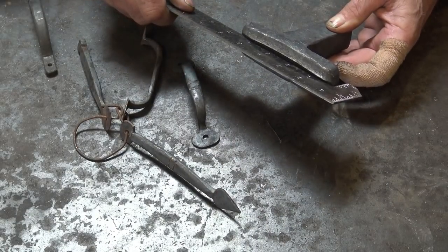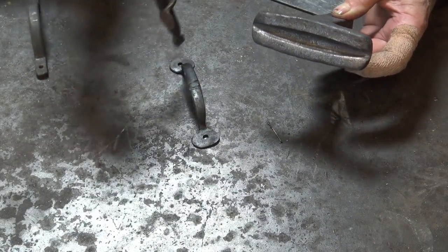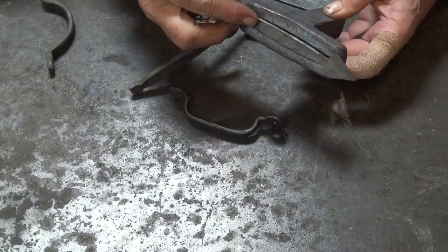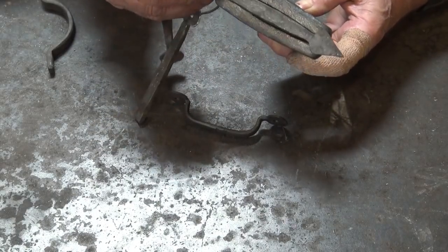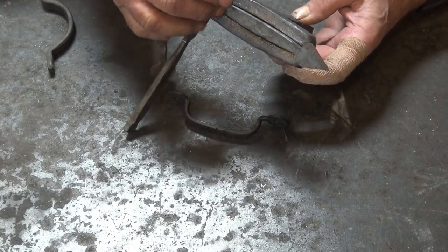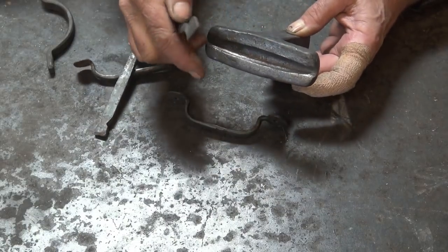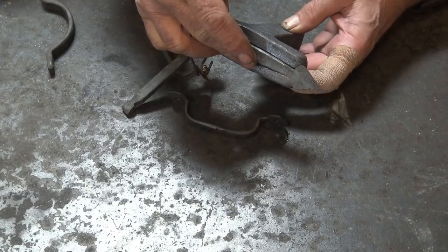Overall this ended up just about 4 and 3/4 inches, and that's not bad. What we'll be doing is sinking a cabinet handle blank — here's the handle — and while it's straight we'll sink it down in that swedge and create a nice domed surface that will be more comfortable to the hand. This is a hair long, but because of the offset where I do the finial ends and the fact that this sweeps down a little bit, I think it's going to work just fine. We'll try it and find out; if not we'll modify the tool.